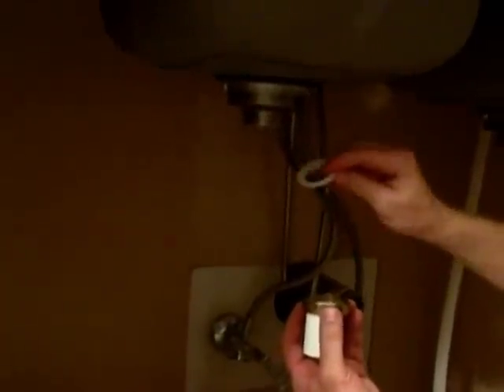For a sink basket, we're going to use a specialized sink basket washer — a tail piece washer. There's a flange on one side that sets into the tail piece, and the top is perfectly smooth to connect flat against the bottom of the sink. I'll do this on both sides and then we'll go to the next step.